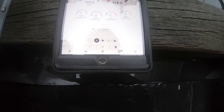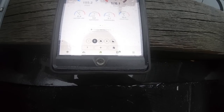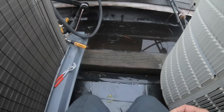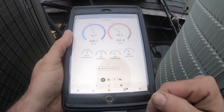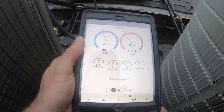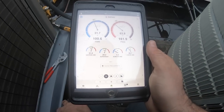Look at that, I did it, it went 2.2. It moved. Oh, it went down, it got my hopes up. Okay, I'm going to drop my pump off, let it run for a few minutes and see how it's responding. All right, I put a few things away and came back. We're now at 3 degrees of subcool, we're getting there. Liquid line is 60, suction 51. We're not fully charged yet, but that looks a lot closer to where I want to end up.